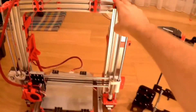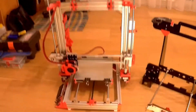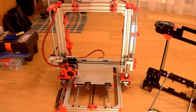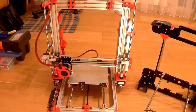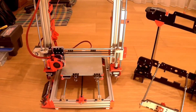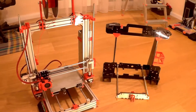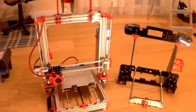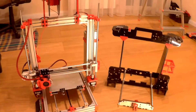This is why you want to move to an all-aluminum frame. First of all it's very sturdy — you can move this machine around and it's going to keep the calibration spot on; you won't have to recalibrate it. Also, because it's going to be more stiff, it's not going to translate as many vibrations as the old frame. It's just way, way better than the plastic one.